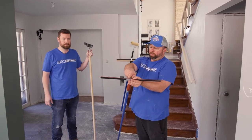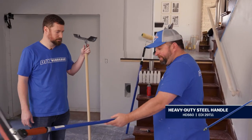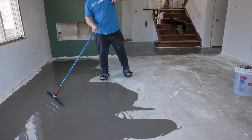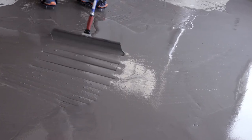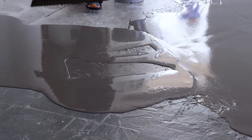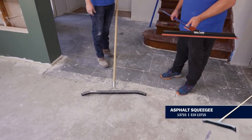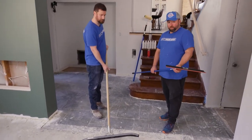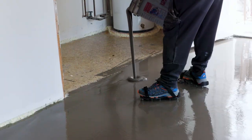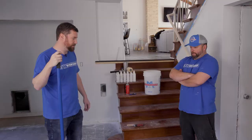We've got some squeegees and a concrete placer in case we run into something unexpected. There's an adjustable-blade tool on a five-foot handle — useful for drywall or similar work — that lets us reach without stepping into the overlay. It's for pulling material back toward a higher spot if we go a bit thick. Zach's squeegee is more for moving material forward. After about 12 hours it should be set, so tomorrow morning we'll be laying the floor.